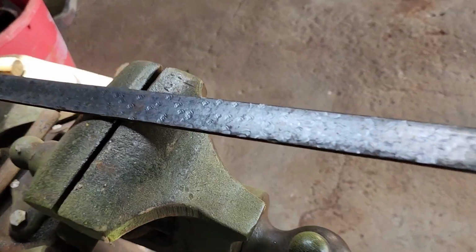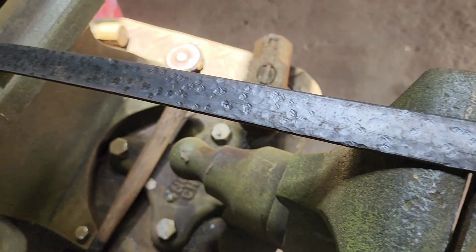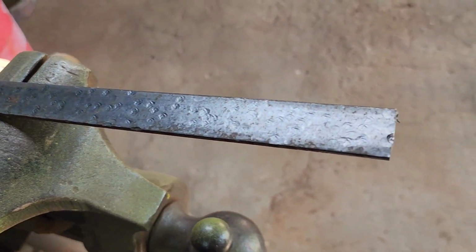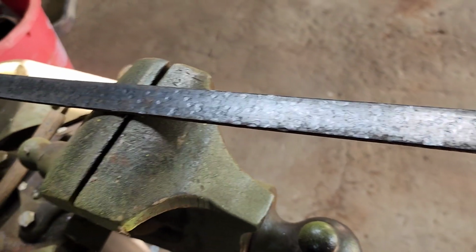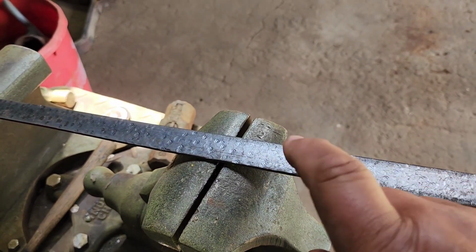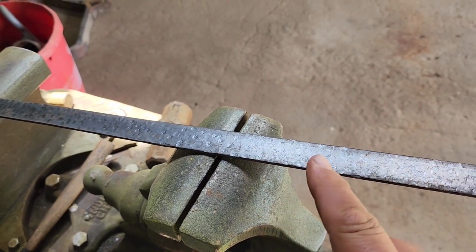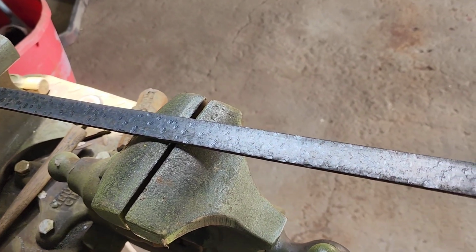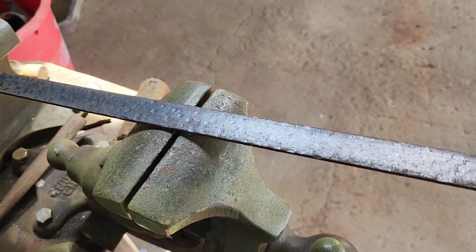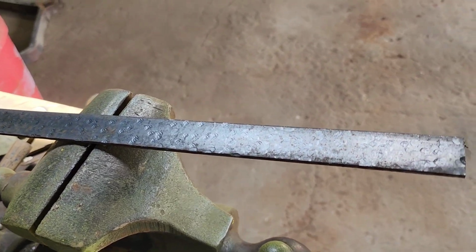All right, that's the hand hammered finish we were looking for. And you can see also as we were hammering it out, it's curving that steel, and that's what a ball peen hammer is supposed to do. It stretches the metal. It stretches it by pounding it this way, it stretches it that way, which causes the metal to curve. You can do that with a piece of flat sheet metal as well. You can cup it out and make like a bowl.